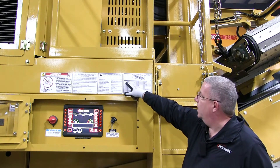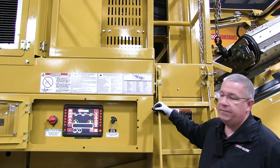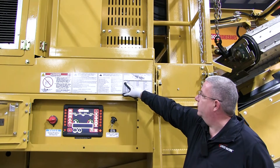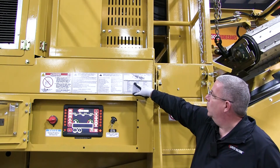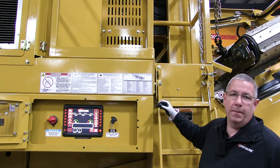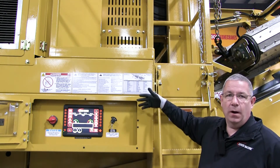The next item is a feeder shaft seal. That item is listed with its reference number on the chart — one grease fitting every 40 hours, one pump of grease.